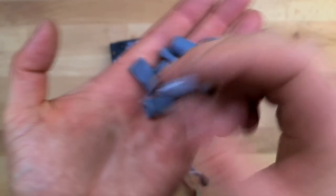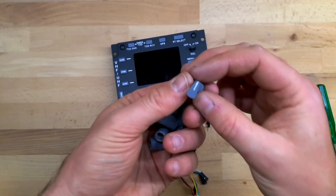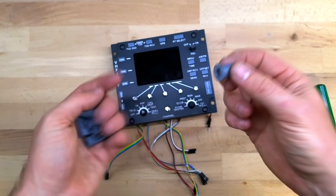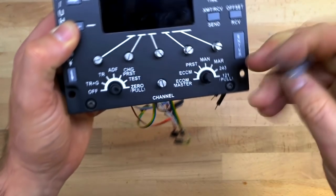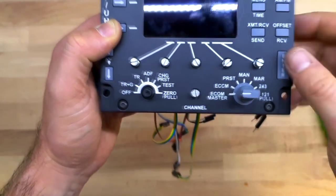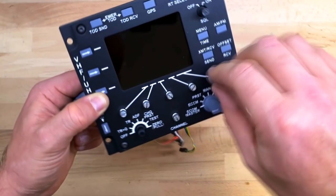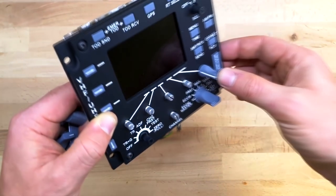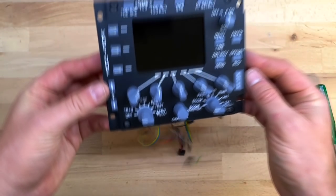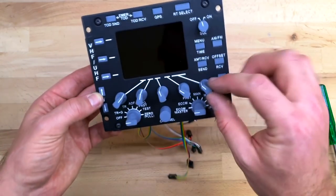For knobs I'm using these 3D-printed replicas I designed myself - not from measurements or scans of the real thing, just guessed by looking at photos online. The STLs for all of these knobs are in the description below and they simply press-fit on. There's a grub screw in there which locks it on. The ones on the encoders don't have grub screws - I just made them the right size so you push them on. I painted them and used sticker paper to cut some lines and stick them on, and it works well.